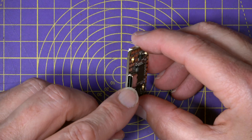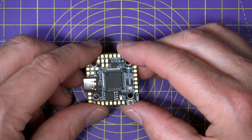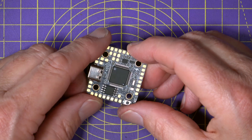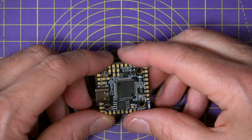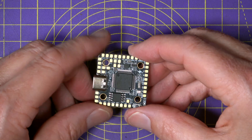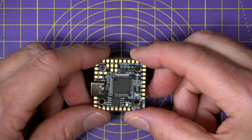Connectivity for connecting to a computer is a regular USB-C. Power handling is pretty familiar as well — you get a 5V and a 9V BEC, both at 2 amps, which is more than enough to cover most receivers, VTXs, and cameras. You can power this from 3 to 6S, which is pretty standard, but there is an 8S version available on request.